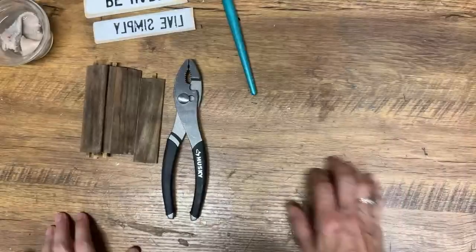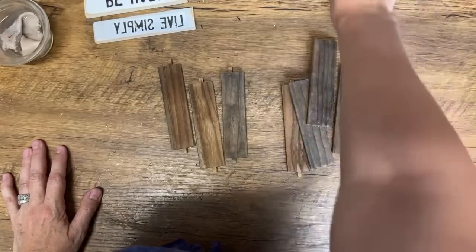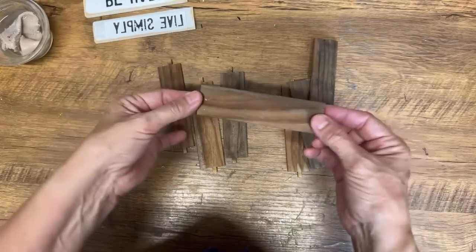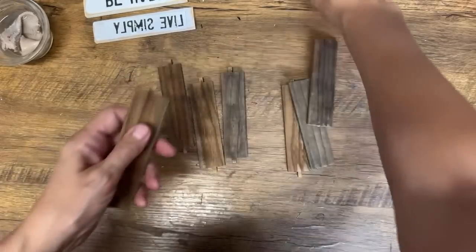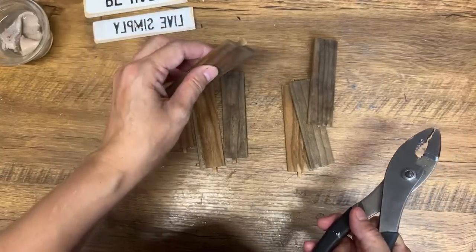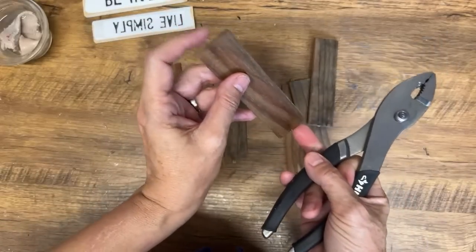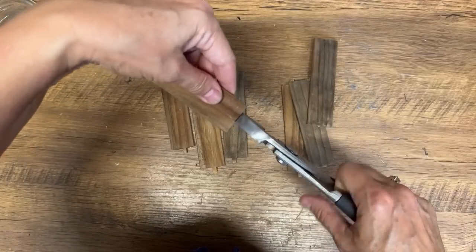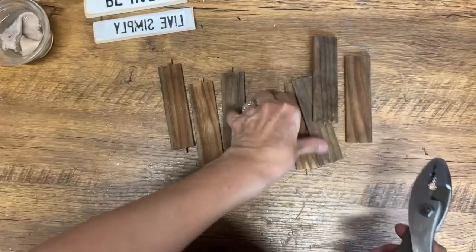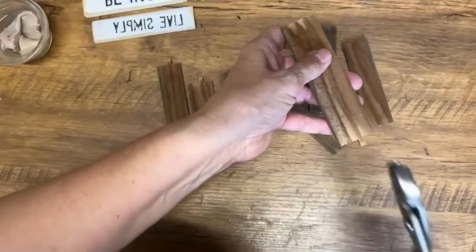Okay, so this is what I'm talking about — these are slats from a shutter. They're really easy to take apart, you can deconstruct them. These are all the slats that go down along the shutter and you can turn these into ornaments. If you're finding an old ratty shutter, they're a bugger to paint, so that's why I always like taking them apart — I can actually make more money taking them apart than taking the time to paint the whole shutter. These had little tabs that fit in the outside; I've just got a pair of pliers and you just take your time — see how they snap off really easy. You can take those little tabs off and then they're ready to paint. Now you've got a little piece of wood.